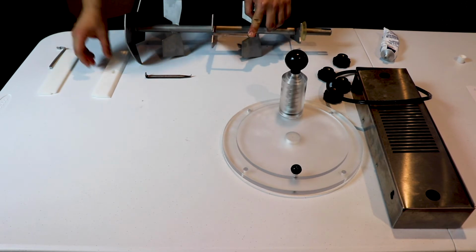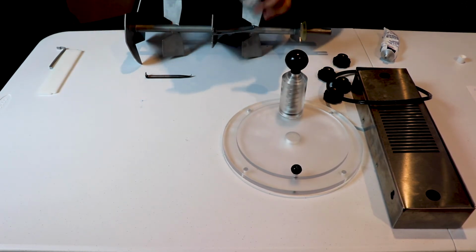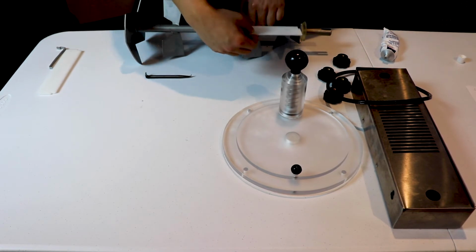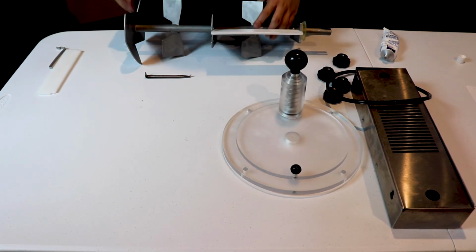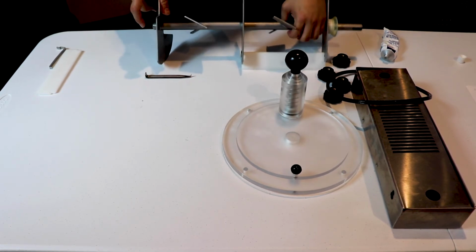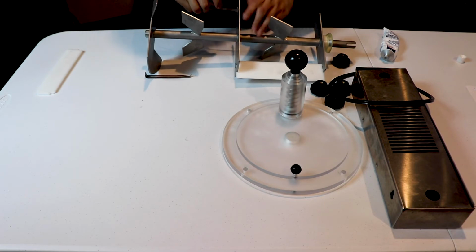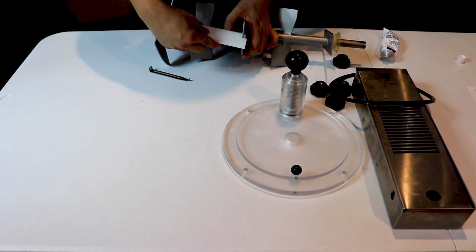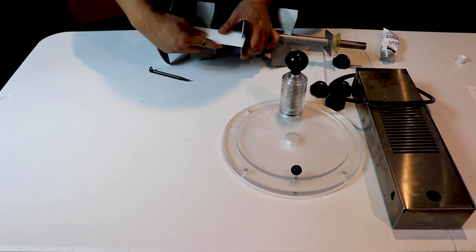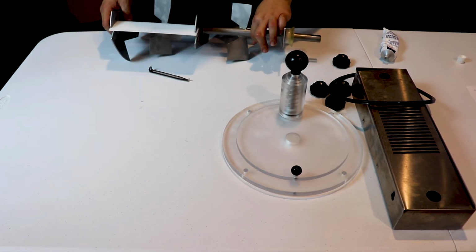like a spring. Then we're going to take the beater with the sharp side facing out. There's a groove right there, and we're going to put that back into that notch for that spring to hold it together. So we're going to do this on the other side as well. So it's going to go through the hole and out to the notch. Alright, and then we are going to put the blade on, and it snaps right onto the spring. And that will be your beater completed.